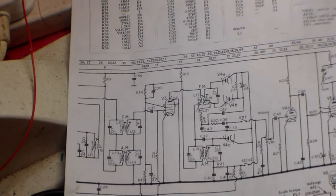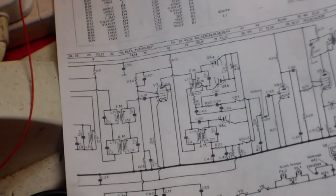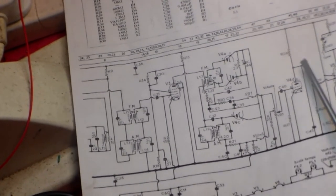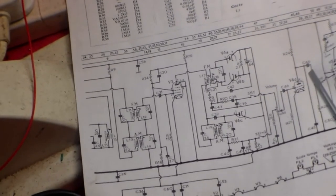Although capacitors are the bane of our lives. There are many people out there who change a lot. Do that if you want, but do please make sure, first of all, that transformers are okay, and also that there's no other faults as well. Fault find before changing. You learn a lot more if you do that, and of course you find out more about the set and how it works. So don't ever change anything without fault finding first, apart from that capacitor. Change it without fail. Change that one all the time.